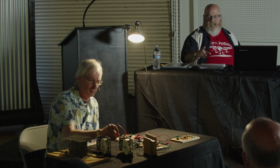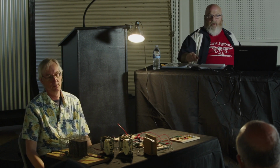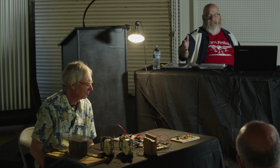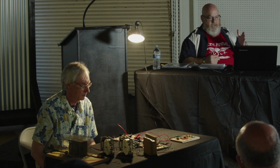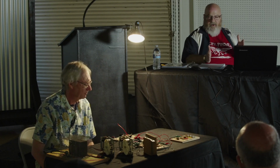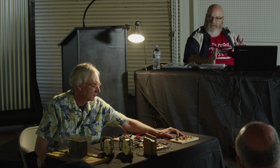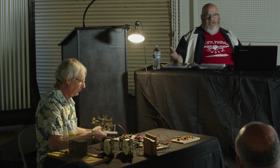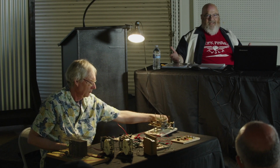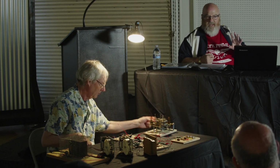In the case of what we've built here, consider the highest denomination score reel on your game. You have a 10, a 100, a 1,000, and then you have a 10,000 reel. But there's no 10,000 relay. There's nothing on the playfield that scores 10,000, right? So they don't bother building a relay.